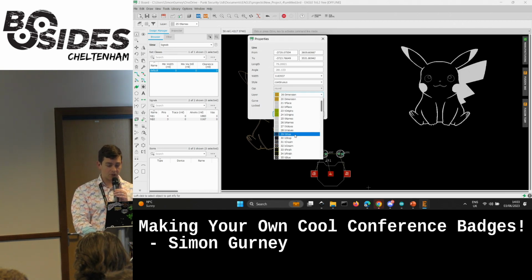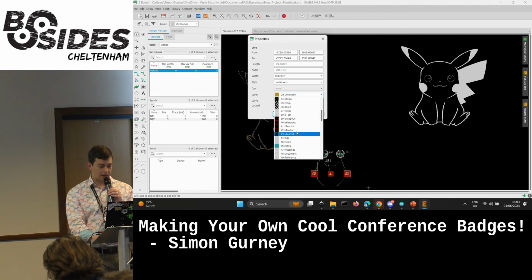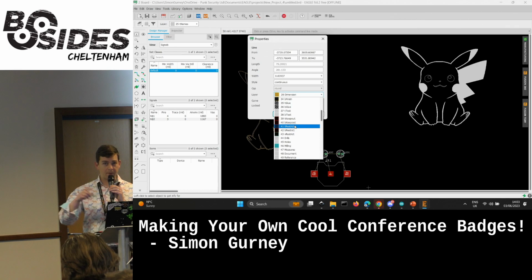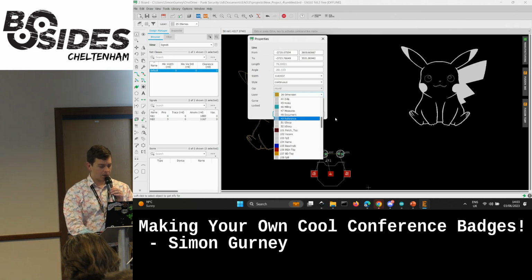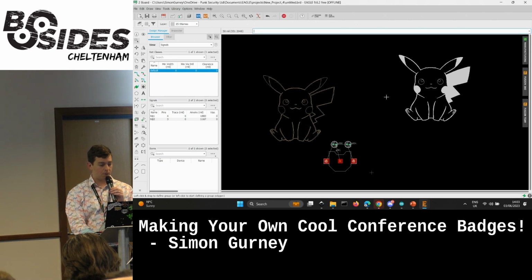T-stop tells it where you don't want solder mask, so that is where you don't want the mask on the board. And then T-restrict, we use on the DeLorean. That's the one where we say we don't want copper here. Okay, so that's all your layers for the board.